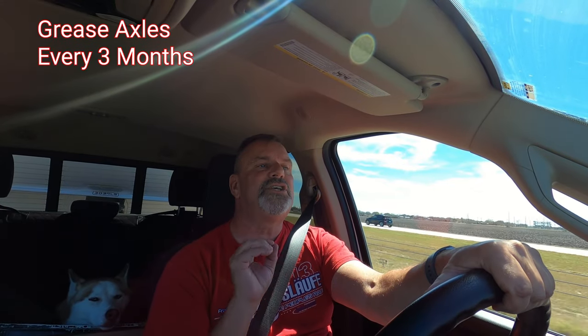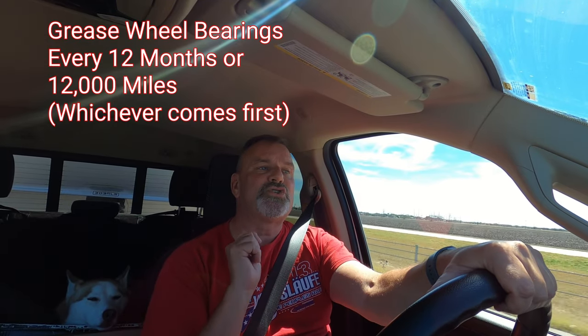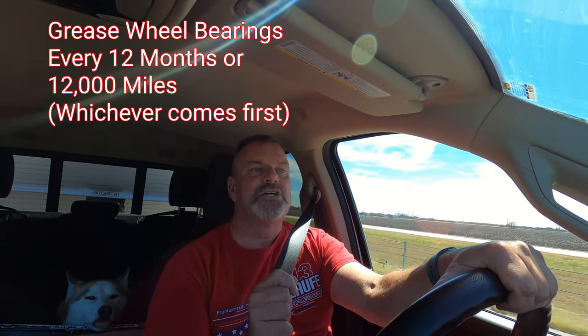So, what we have determined based on Dexter, the manufacturer's information, is using the EZ Lube system is perfectly fine as long as you maintain it properly. Now, what does that mean? I told you in the video that you should do your axles every 3 months and you should do your wheel bearings every 12 months, but that's 12 months or 12,000 miles. So you want to be careful of that. If you exceed your 12,000 miles, go ahead and do it if it's more than that. But that gives you a rough estimate of how often you should do it.